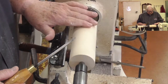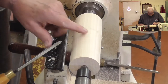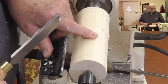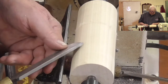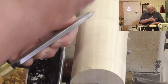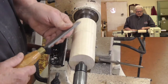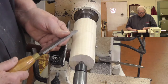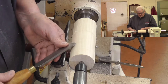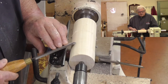I'm just in the center of this piece of wood, and you can see the little trails of where I ended and the difference in surface. You also saw that I was moving pretty much my whole body — I had stiffened this triangle between my two arms and most of the motion left to right was with my feet and my legs. When you start moving just the arms, that's the chance you risk getting a catch when you come up off of the surface and get the edge too close.